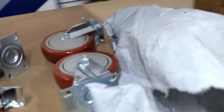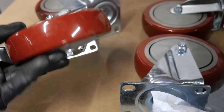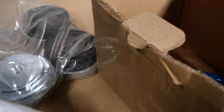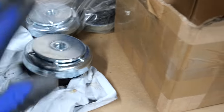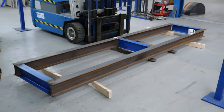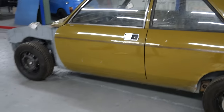I've got some casters — as is the case when you order things off eBay, I wanted really heavy-duty casters. These don't look too bad but they might not last. Realistically this is just for moving the jig around; it will actually sit on some legs. I've also got some wind-down feet so I can make sure the jig is flat at all times — they have a winding screw so you can wind it down and level the jig bed out.